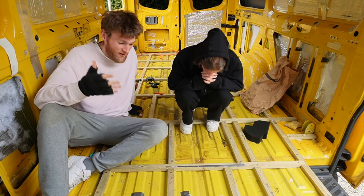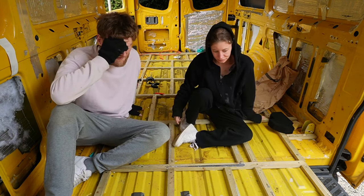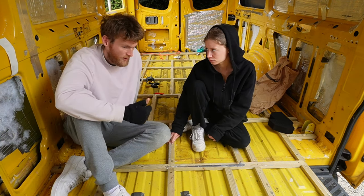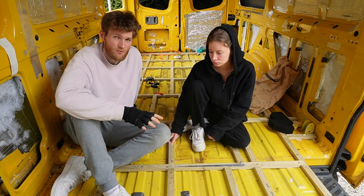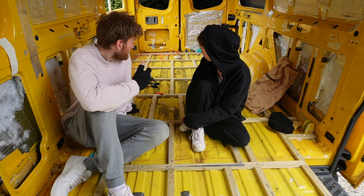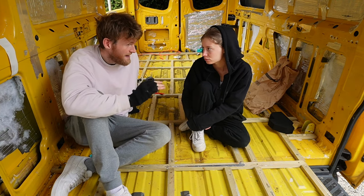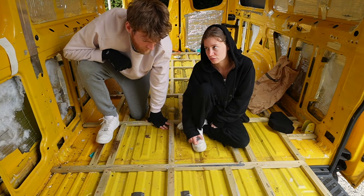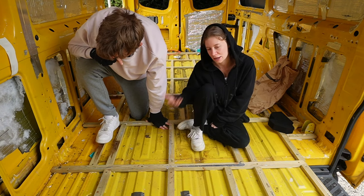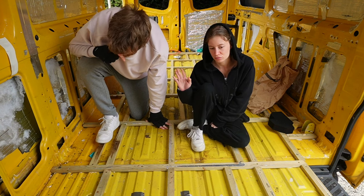We were having a discussion — I've been saying, and SJ has kind of been in agreement, that we just go in between and clean all the gaps. But we've just thought: it's going to be long, but we're going to take all these battens up. It allows us to find out where all the holes are and fill them with a combination of JB, epoxy and hardener. The bigger holes we can fill with fibreglass mesh. We're setting ourselves back probably at least another week — fortnight perhaps. We can do this inside so it doesn't matter if it's raining. We've made peace with it: it takes as long as it takes.